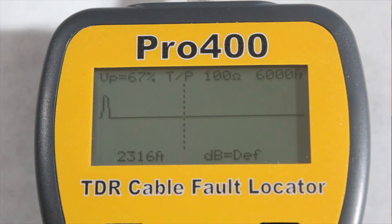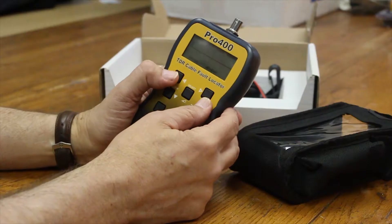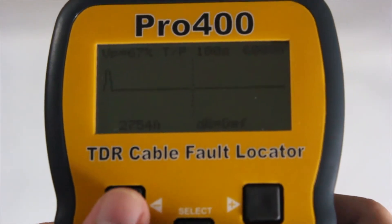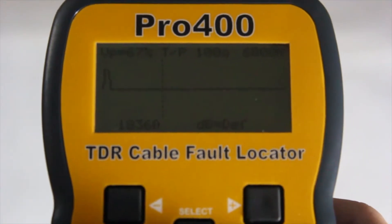The screen has a display of wire radar returns that allow you to see faults — shorts, opens, that kind of thing. You move the cursor to the location of the fault that you see on the graphic display, and it tells you the exact distance to the fault.